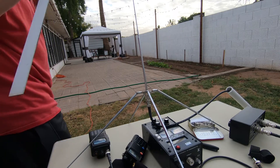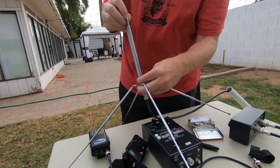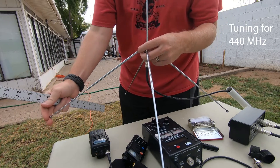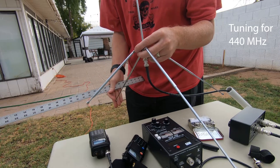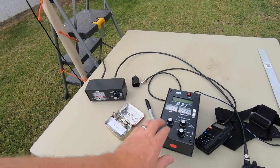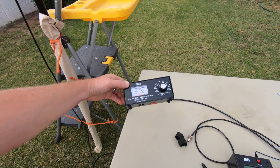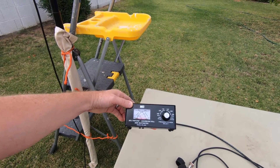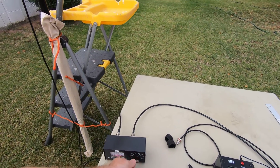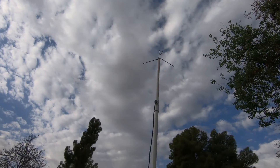Now I'm going to measure these to just six inches for 440. All the telescoping whips look too long, so we're just going to bring them all the way in and hope for the best. We're going to use the SWR bridge because the MFJ doesn't go to that high a frequency. So we're just going to key up and see what the SWR bridge says on 440 with the telescoping whips all the way in.